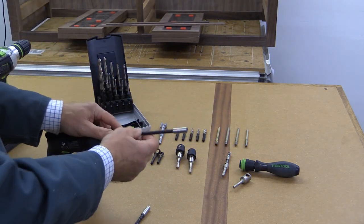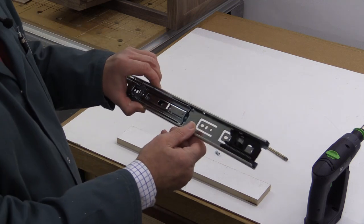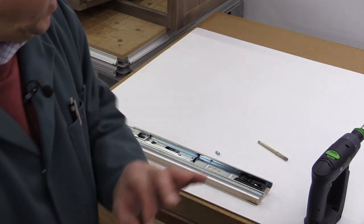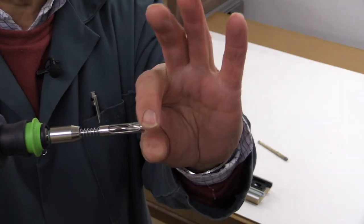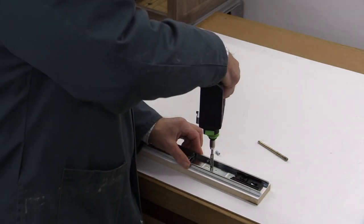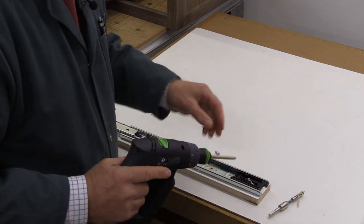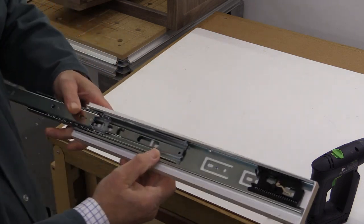In the background you can see the cabinet I'm making — I'm using Accuride drawer runners and need to drill the holes for the Euro screws. This is the sort of screw I'm talking about. Festool have come up with this rather nifty gadget included in the set: it drills the hole but also has a centering feature. You position the item where you want, drill through, then simply remove it, put in your screwdriver bit, and away you go. That's held nice and firmly.